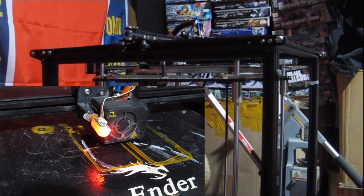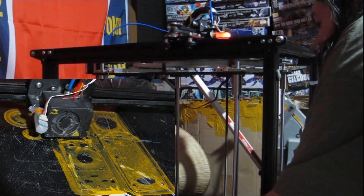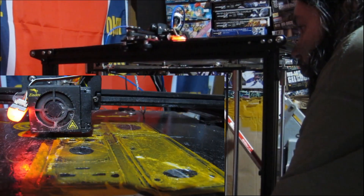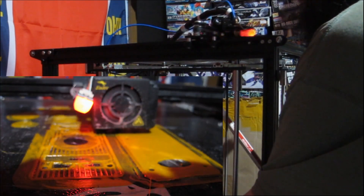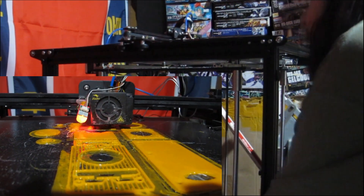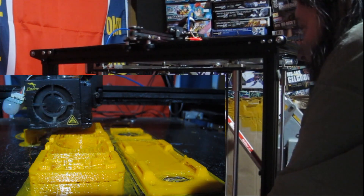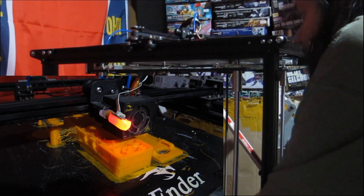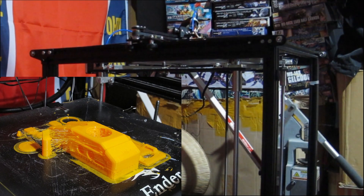It takes about 4 or 5 minutes at the start of the print as I'm demonstrating here. As I'm laying down the first layer, I try to get that nice squish by eye, and after that I slow down the print speed to about 20%. There's a bit too much heat and it strings between 2 to 3 models on the build plate, but I get some quite nice sharp detailed proportioned prints that do not fall apart, with fairly good Z-axis artifact markings. With this method, larger heavier prints do not pop off the bed and I haven't really experienced any failed prints for a while.